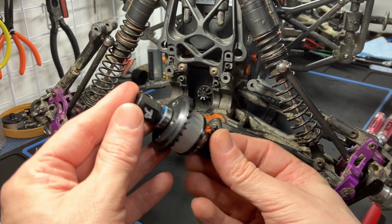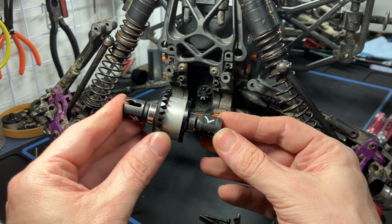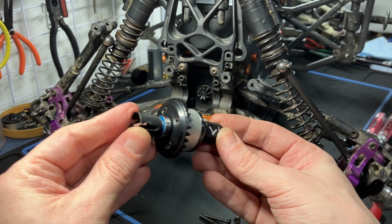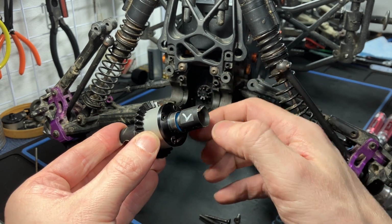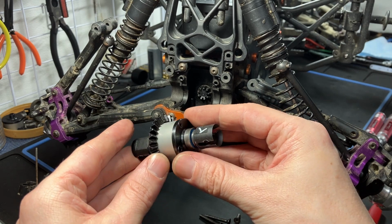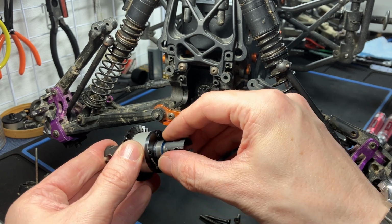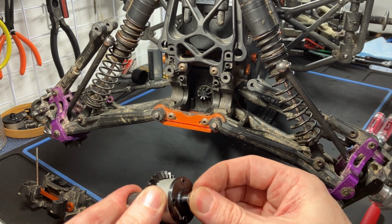Right, so once again, for the purposes of this video, I don't have any inner gears installed, just so I can easily remove the outdrives for shimming. But for you, you will have this assembled with no oil and no Loctite, and you'll have to remove these 4 screws on either side when you're shimming. So it's a little bit of a pain, but quite a necessary process. All right, so anyway, let me continue. So take that off. I'm going to add a 0.3 on there.